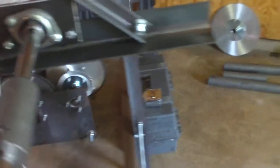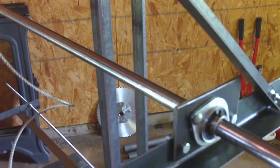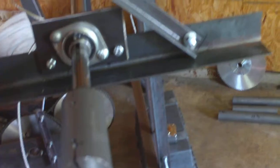You might be asking why am I doing all that? In a previous video I talked about deflection in this shaft, and it was pretty significant. I actually measured it. I was getting bad deflection right in this area where the main winding wheel is — the shaft was bending. I measured it under load; I don't remember exactly what it was, but it was enough to create a big problem with the chain: way too much slack. The mathematics I worked through confirmed the deflection within very close numbers, so I knew the deflection was real.